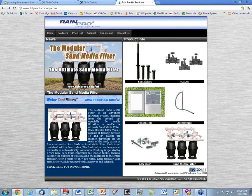But I'm going to show you some low flow stuff. They're just fairly typical emitters, but a range of them. The thing that sort of excites me are these sand media filters. Again, we had Bill Curtis do a webinar last week on tips and tricks. He's been in the business 30-some years designing, and he finds he needs the sand filter almost on any job. Now, he is working in Florida, and maybe they have situations in their water there, but his comment that resonated with me is that really just about everywhere needs protection of your system.